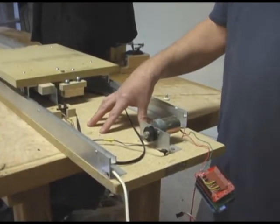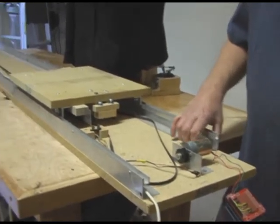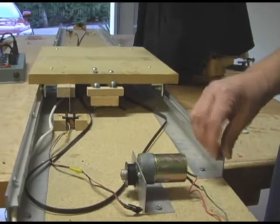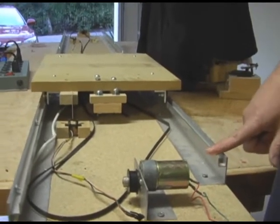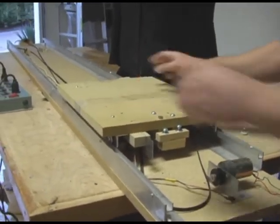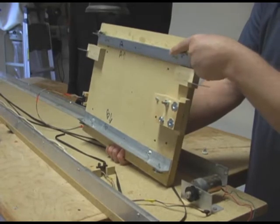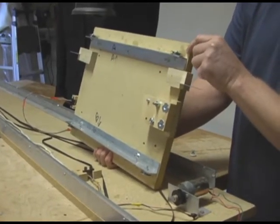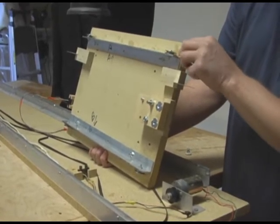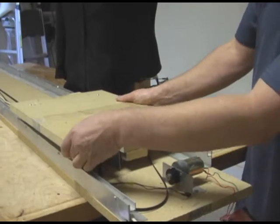The bottom is a piece of three-quarter inch particle board. For the rails that the base will ride upon, I've used an inch and a half L-shaped aluminum stock, and to that I've bolted a U-shaped aluminum stock. The base itself is made out of a three-quarter inch piece of MDF, and on the bottom for the wheels I've used another one inch piece of aluminum L-stock. For the wheels I've used bearing wheels made for sliding doors — sliding glass doors and sliding screen doors — and these wheels have a little slot and they ride right on top of the aluminum stock.